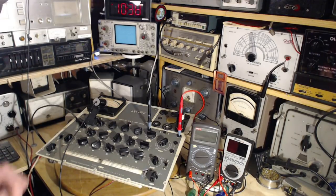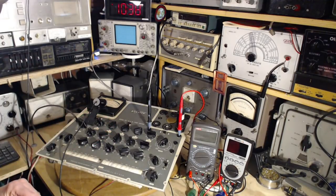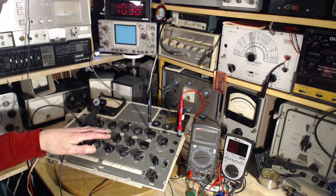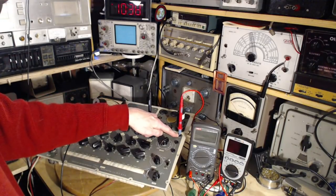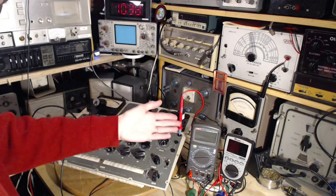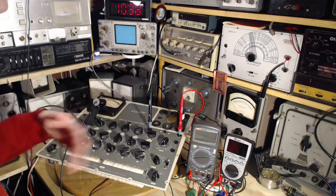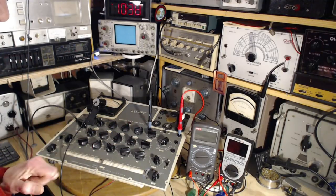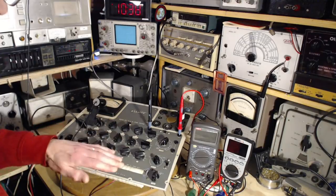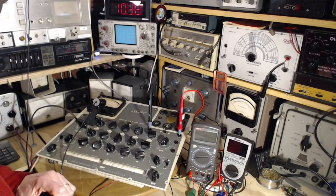This is an unusual kind of calibration step - it makes you do something you kind of wonder why you would ever do. During the calibration test, you're supposed to read the current flow between this plate cap terminal and the grid cap terminal, which is kind of weird to put an ammeter between these two points. The test did not work; I never saw any current flow here. I'm thinking it's because I didn't have one of these set correctly. The tester seems to work on the emissions test - this is about calibrating the emissions test.